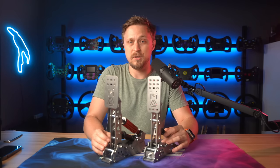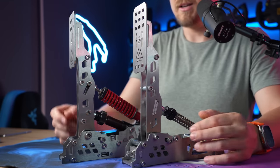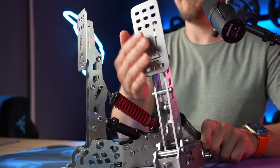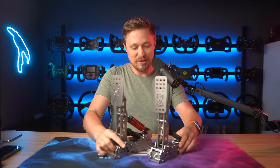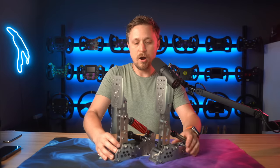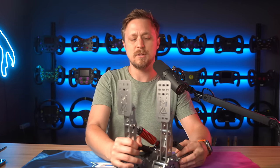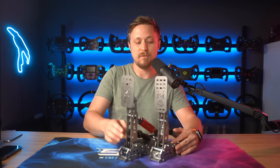We'll start with build quality and specs. Overall, build quality is a little mixed bag. We do have the typical laser-cut stainless steel assembly here. There are absolutely no sharp edges anywhere, and it looks pretty cool with this brushed look — except for the throttle faceplate, where the brushed look is not available. There are occasional burn marks on some smaller cut areas, and a little better cleanup of the parts would be nice, but it's not the end of the world and you can remove them yourself.